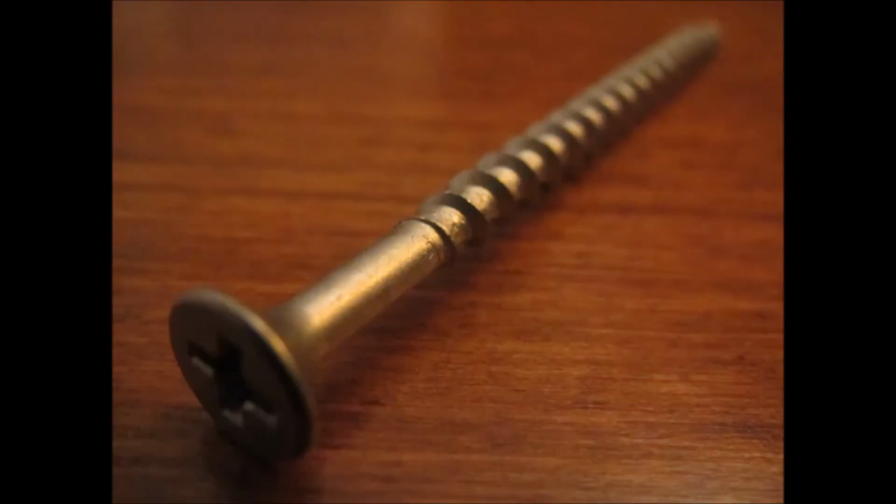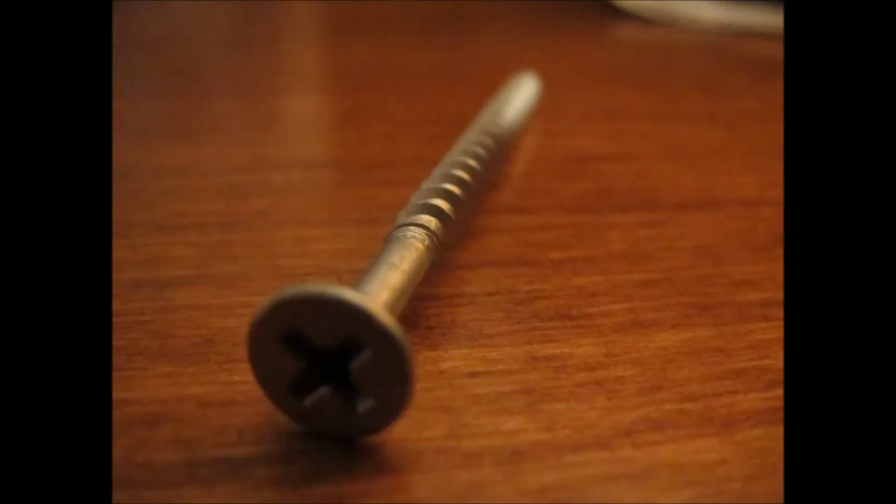Treated lumber, which is highly prized for its resistance to fungal decay and insect attacks, is created by forcing chemical preservatives into boards through a vacuum and pressure process. The problem is that the same preservatives that extend the life of lumber attack and destroy the integrity of traditional steel screws. The zinc coating on these galvanized screws allows them to resist rust and deterioration typically found in other types of screws. Galvanized screws are greatly used in this situation because they last longer when put into treated wood.